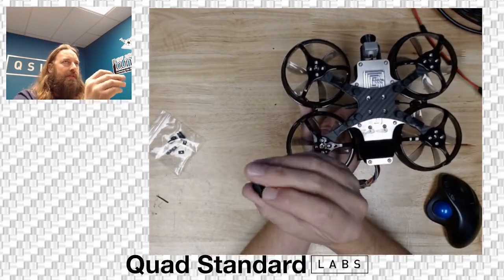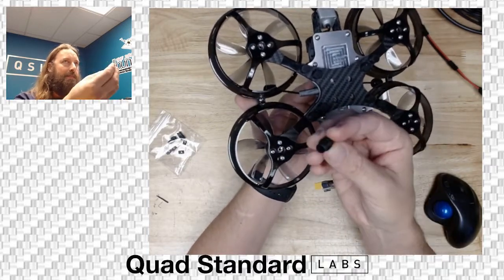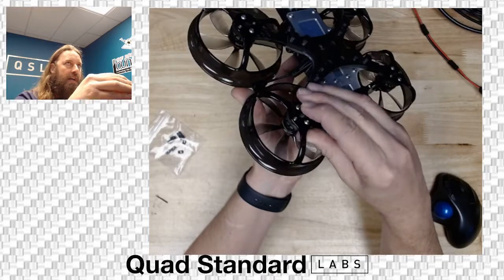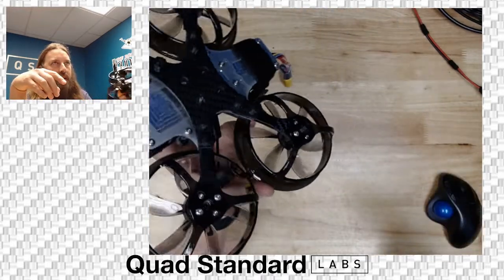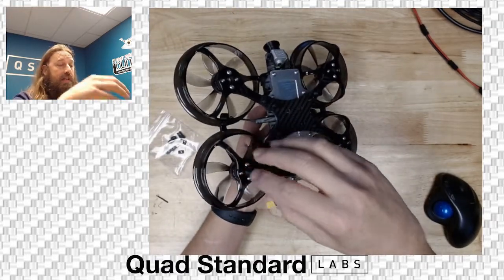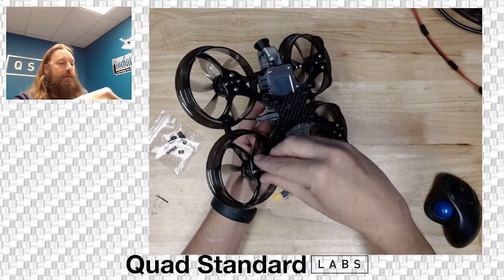available in the description. You can find a link to our Thingiverse, but print this thing just out of solid TPU or PLA, whatever you want. I use TPU, and it fits right into the armhole and the duct. And if you push it straight down all the way in, it's hard to see black on gray, I understand, there you go. It helps locate and center the duct, and now I can tighten down those two screws and everything should be as centered as possible.